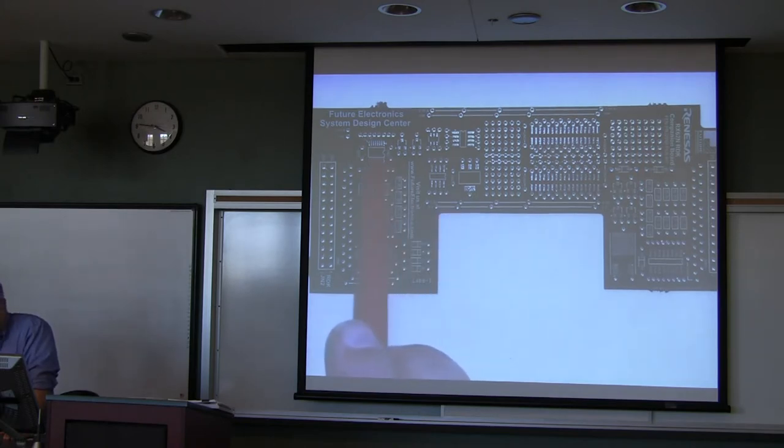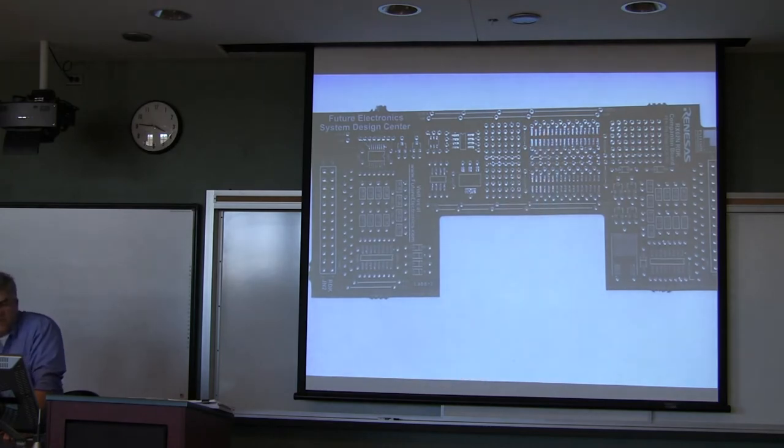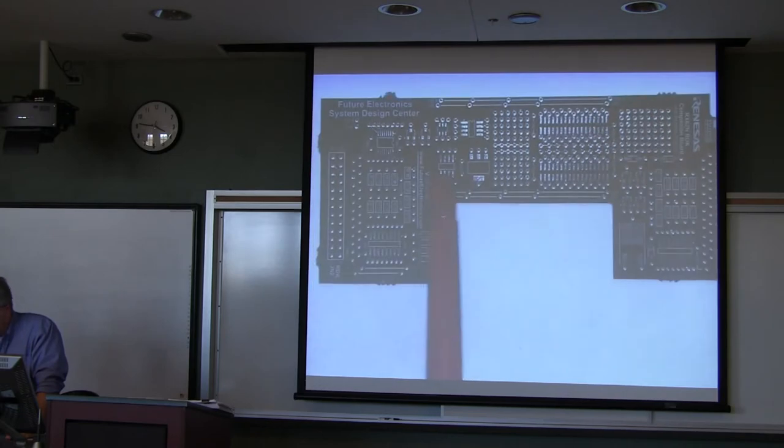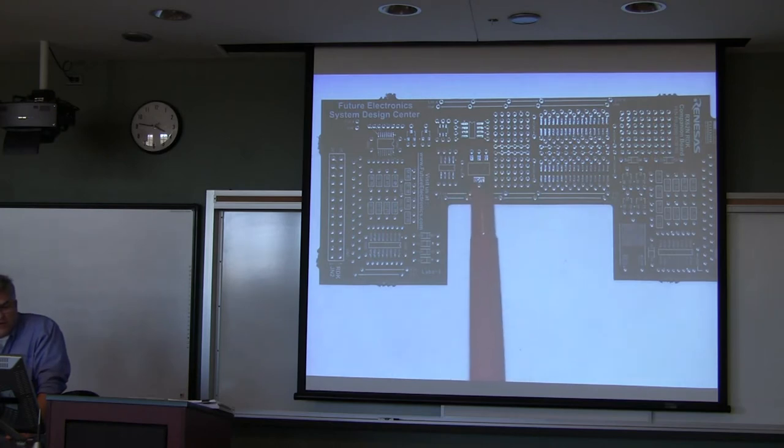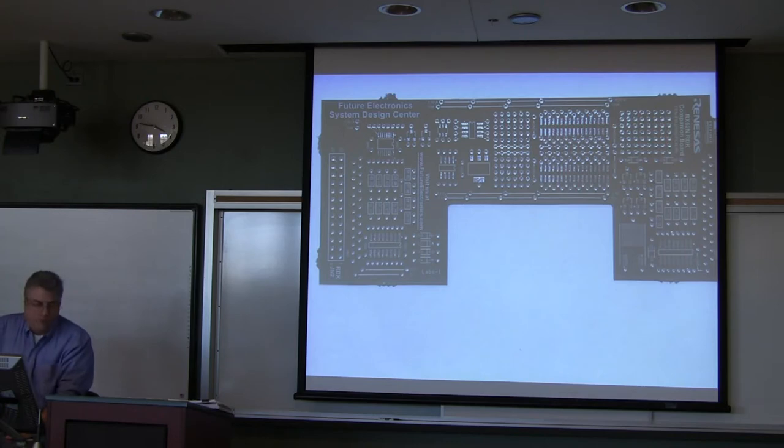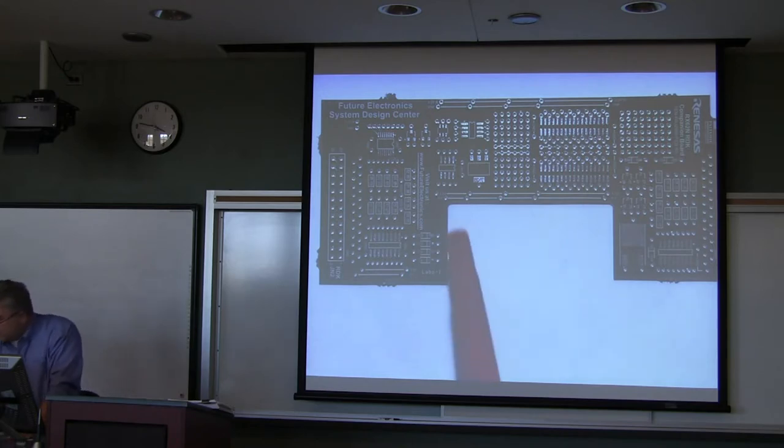One, notice this area right here has a surface mounting area that you could put on. How many pins is that? A certain number of pins. I can't even read. 16. And then there's another area over here that has surface mount area for 8 pins, another one over here for 6, another one over here for 8. What does this look like right here? It might be something like a voltage regulator where you have multiple pins that will handle something that is 3 or 4 pins with a big giant area right up here